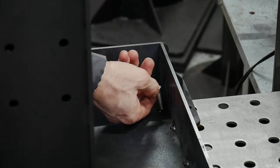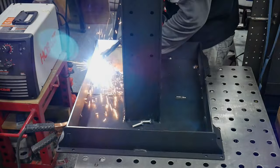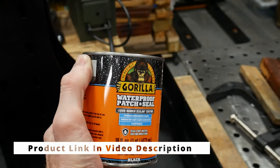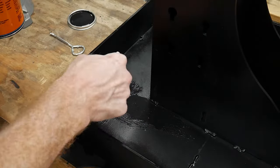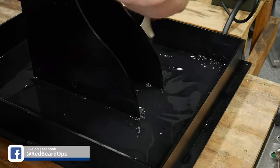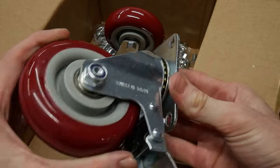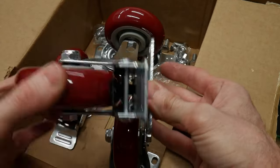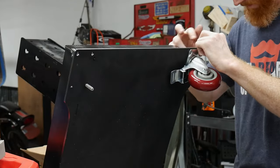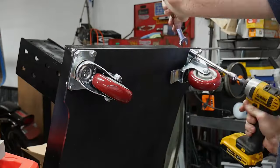Before we pour this base full of concrete, we need to weld in our fasteners for the casters. Note: if you forget this step, you really don't have any good options for affixing your casters other than doing so with one of the four bolts missing. I figured it would make sense to put down a sealant before pouring in concrete, since concrete retains moisture and could rust the stand over the years. I used some Gorilla waterproofing rubber sealant for this purpose — I started off trying to brush it on, but ended up just pouring the entire 16 ounce container into the base. Per Richard's suggestion, I ordered these 4 inch casters off Amazon rated to 2,000 pounds. I'll put an affiliate link in the description. I attached them to the base with the provided hardware.